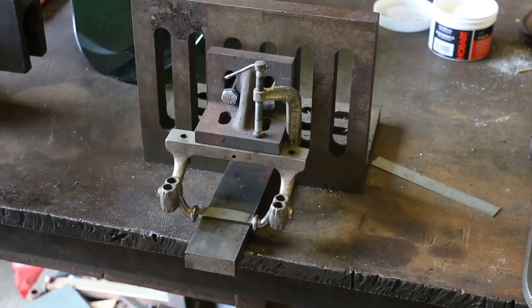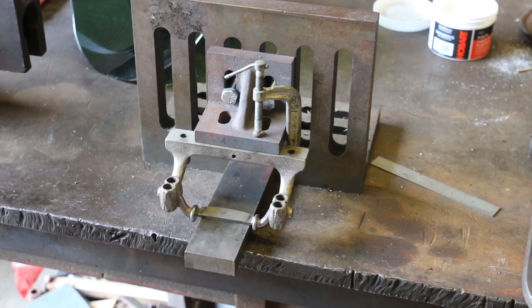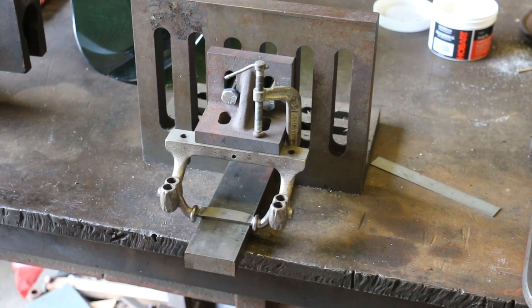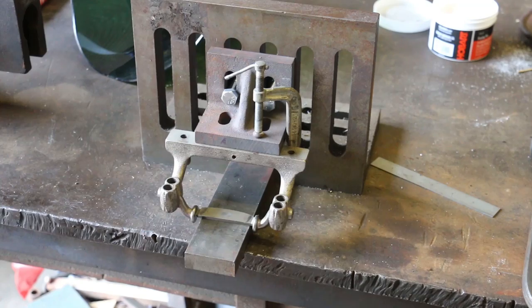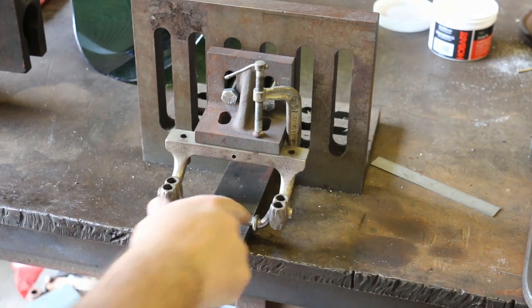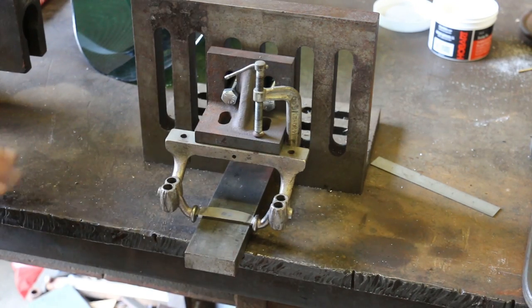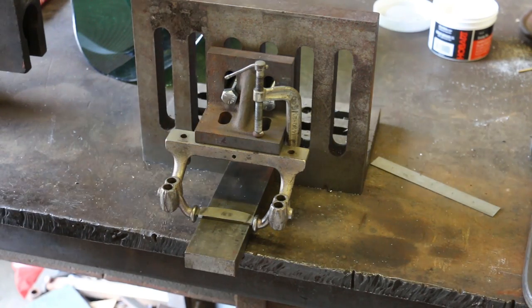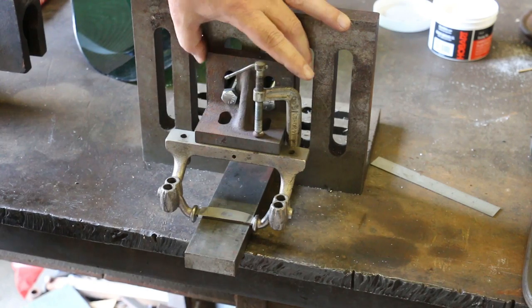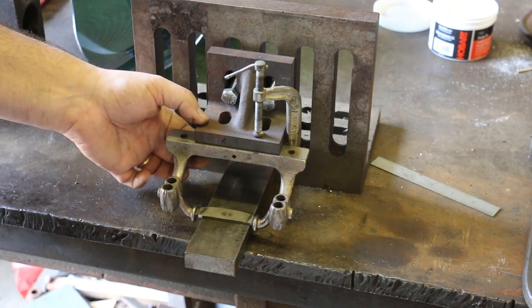While this other piece is cooling, I have come over here and set up the second piece that needs to be brazed together. And again, getting this thing properly set up is half the challenge. So I've gone in here and V'd out again an area in there, this little cross piece. And I needed to get everything really held in place real well. So I took a couple of angle plates here. We got this large angle plate that's in the back, a smaller angle plate mounted on here that I can adjust up and down. And then on this, I just literally clamped this fence.